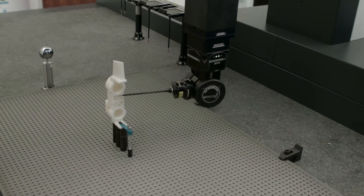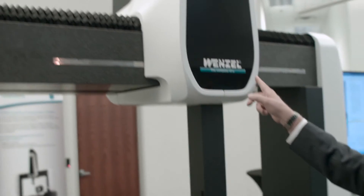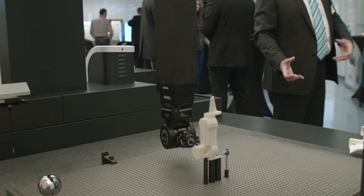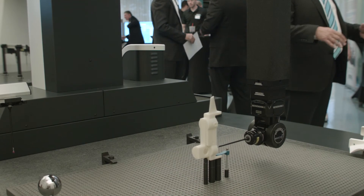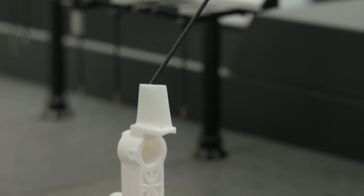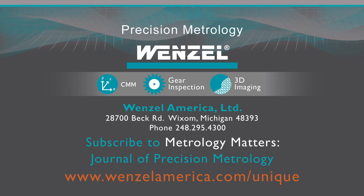It's a great product because it's made of all granite — made what I consider the old-fashioned way, with quality and integrity built into the machine at the time of manufacturing. The beam itself is all granite, across here and across the table. We actually core drill all of our granite, so even though it looks like a solid piece of square granite, we take the center out. By taking the center of the granite out, we can reduce the weight, which gives us the ability to have the same performance with an all-granite machine as you can get with a much lighter aluminum machine.